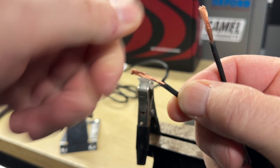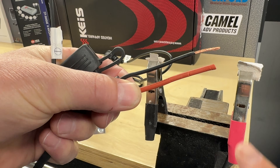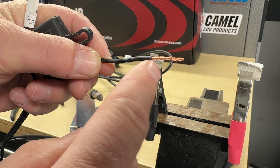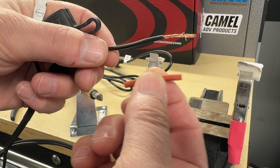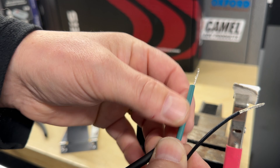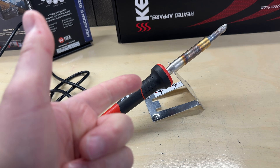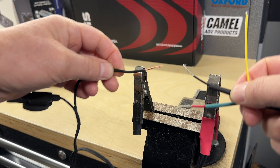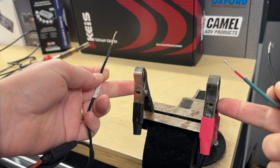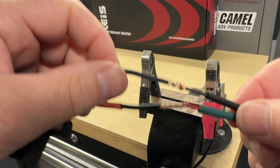Just twist the ends, and in case I forget there's a label on here saying that this is the negative cable. I'm just going to cut that down to size and put it back on the positive cable. I will be putting some shrink wrap over the joint, so to allow for that I've just cut this down accordingly. Then we're going to put some shrink wrap over the cables before we solder them together. Soldering iron is now on, and to hold the wires in place whilst I attempt to solder I'm just going to use these Optimate battery clips, and then we'll just twist the wires together.